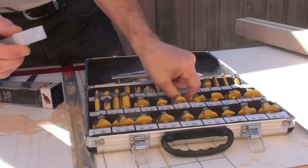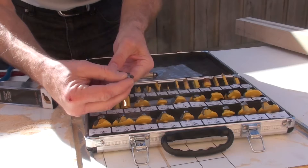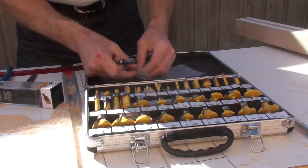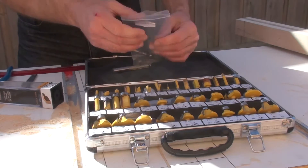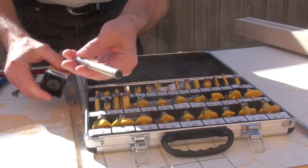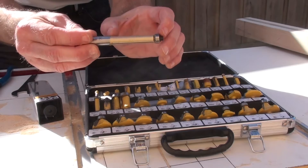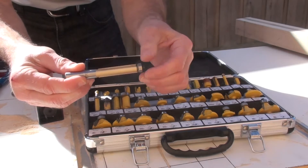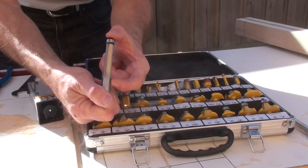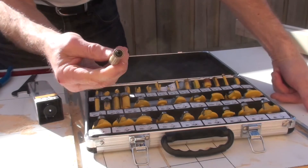Now I've got this bearing out. I've got exactly the same one here — I've taken the top bearing off, and that's the one you probably just saw me using. I have bought a few quite expensive bits. Here's one — it's from Arden, it's a half-inch shank, the others are quarter-inch, and this is two inches or 50mm long. These are called flush trim router bits. If the bearing is at the bottom, they're called pattern following router bits. If they've got a bearing at the top and bottom, they're called flush trim double bearing router bits.